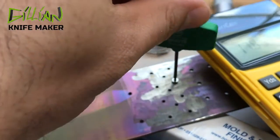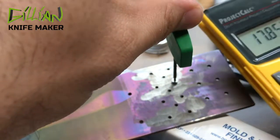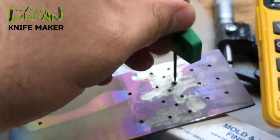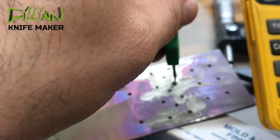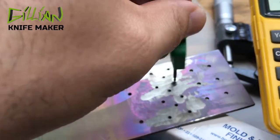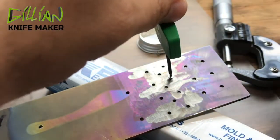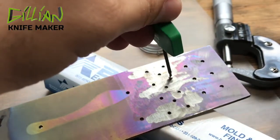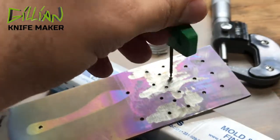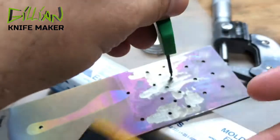As I unscrew, I have a hole in my T driver so I know exactly when I get back to 12 o'clock — that's one thread, which has traveled 17.85 thousandths. Times two, we have traveled 35 thousandths. Three revolutions will be 53 thousandths. Another one should be 71 thousandths. And when we go five, we should be at the full strength of the screw — that will give us 89 thousandths.